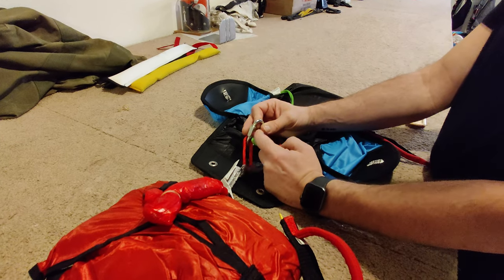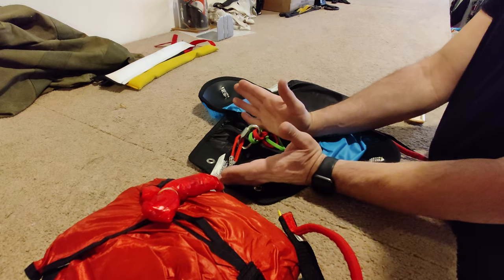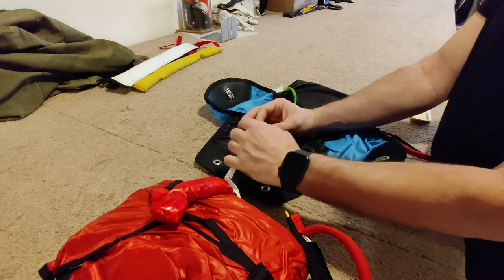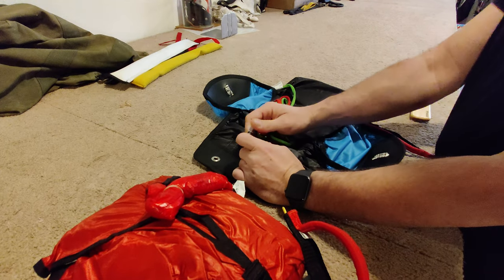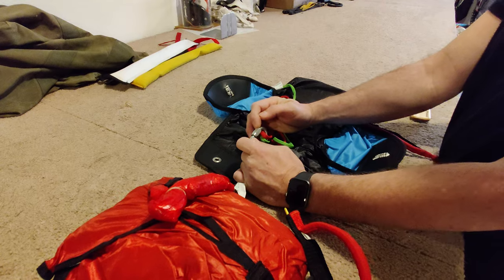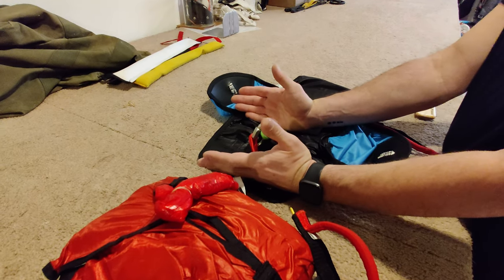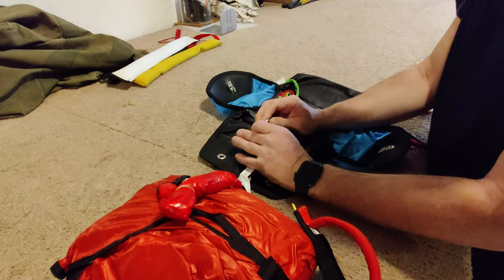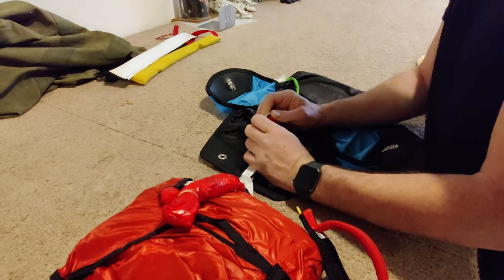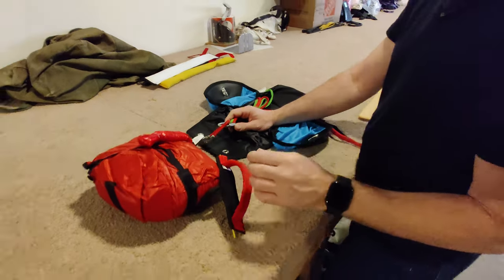But you've got to be very careful with these. If you over-torque them, you can crack the barrel, and once the barrel is cracked, the whole thing can split open under load. And if you under-torque it, then it'll come loose, and once it gets past the threads on this side, the same thing, it will flay open and you come detached from it. But this seems like it's really nice and tight, so I don't want to undo it and redo it.